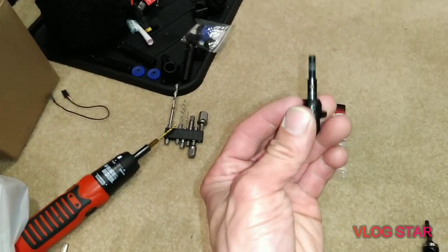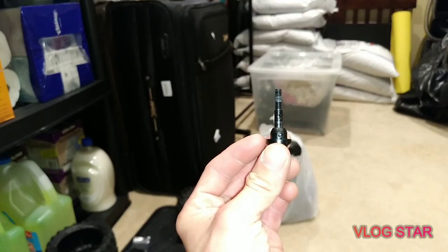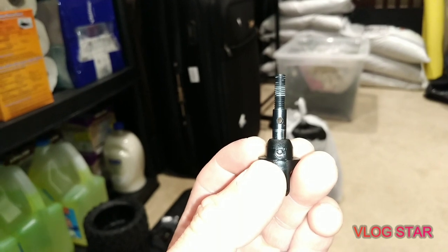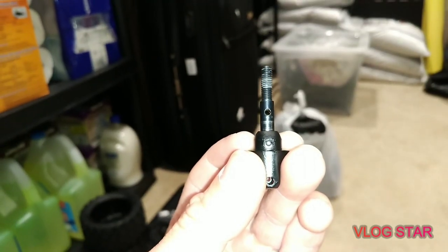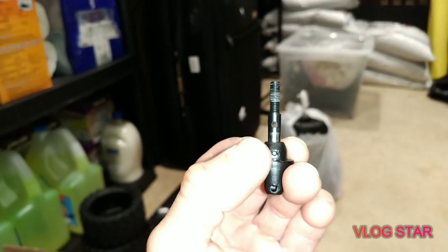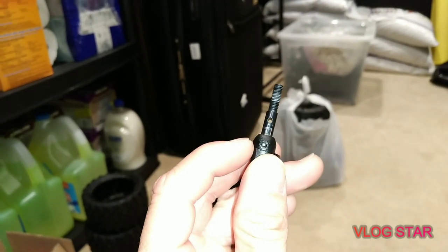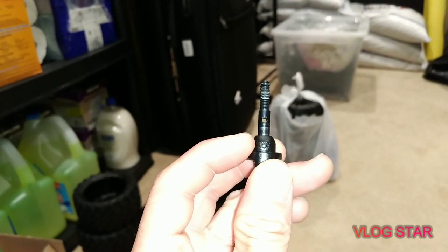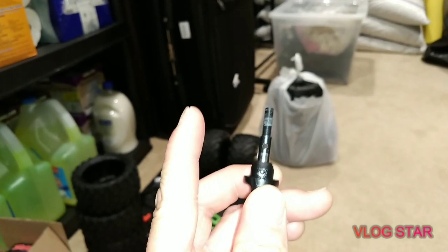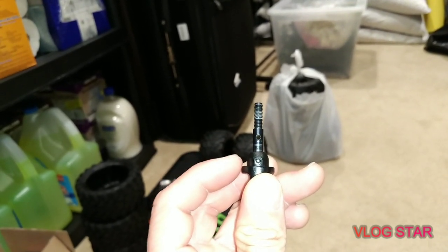That's what happened. You have to drill that hole bigger to install that pin in there. What happened is, focus. I hope this can focus. So you can see, almost reaching the... sorry about this. Yeah, you can see, right? You have to drill it as high as possible, as far to the pointy side, because the hole is quite low, right? So you have to drill it bigger so that the pin can go in. And for you to do that, you have to drill it a little bit towards the pointy side of this outer drive, the plastic part.